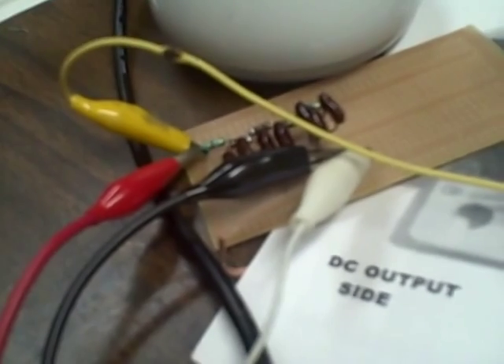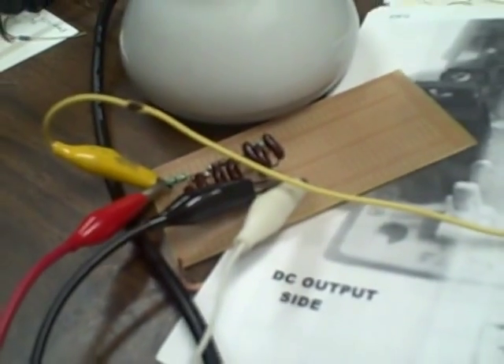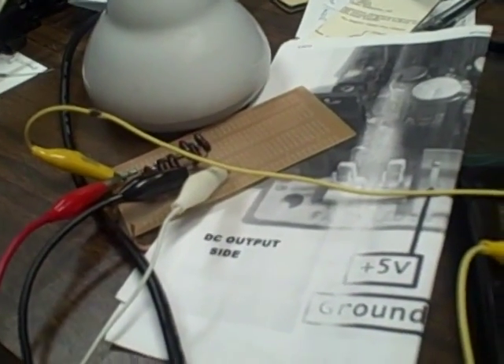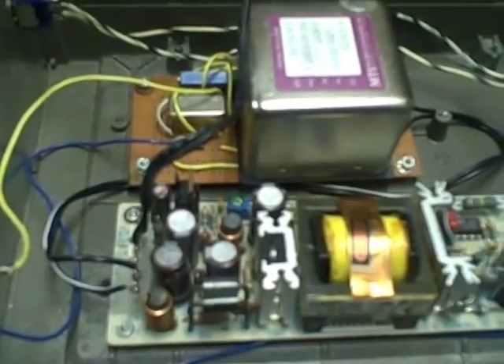The only other thing I'm working on right now is a nine-pole Butterworth ten megahertz filter that I've made up. It helps clean up any of the distortion in the frequency. But in order to use that, because of the additional losses I pick up with it, I'm going to need to build a ten megahertz amplifier and put that on the board as well. Then I've got to find some real estate in here to put all that stuff, but maybe back in this area I can manage it. I'd like to be able to clean that signal up and then boost it up again.